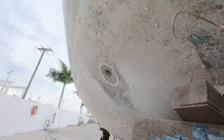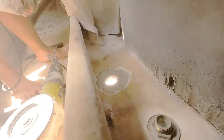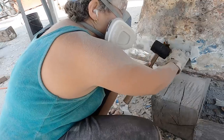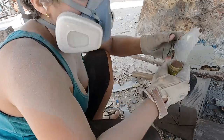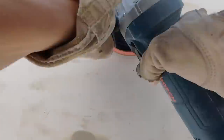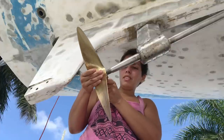So far with this haulout, we've filled in about 10 unnecessary holes in the hull under the waterline. More than half of those had crumbling seacocks. We replaced just two of the through-hulls that we're going to continue using. We addressed all of the osmosis. The hull is as healthy as it can be right now without having sandblasted the whole layer off. The cutlass bearing was replaced, the shaft was straightened in three ways, and the rudder post has been somewhat dealt with so that we don't lose steering in the future, although that's not a finished job.